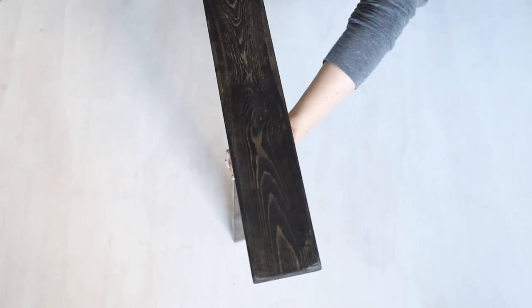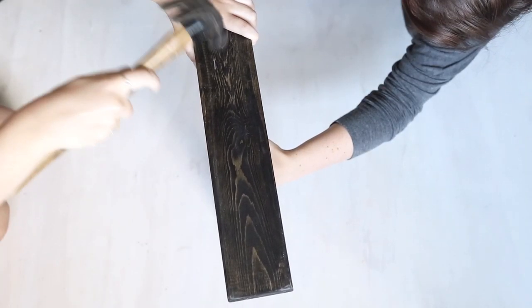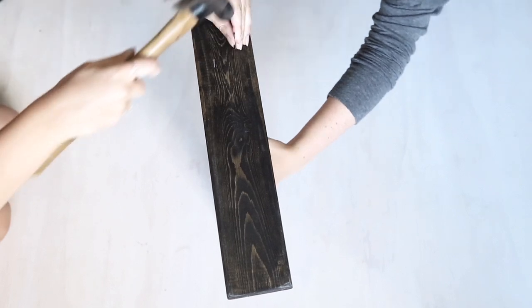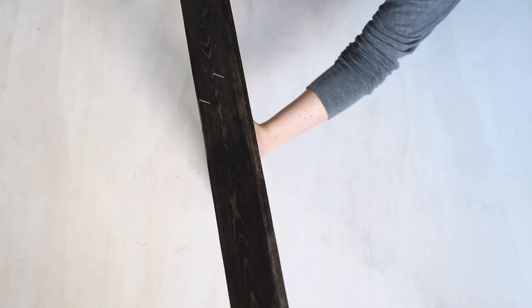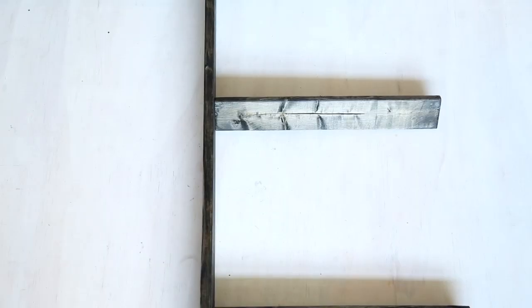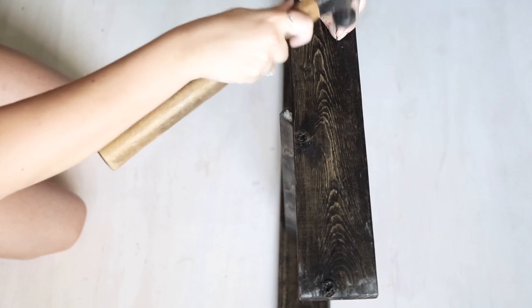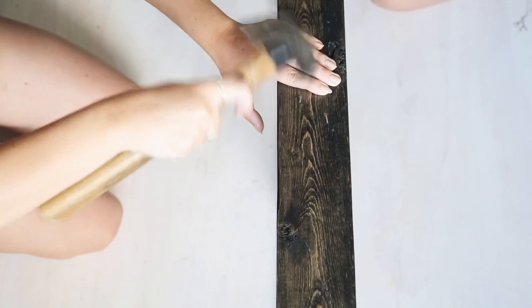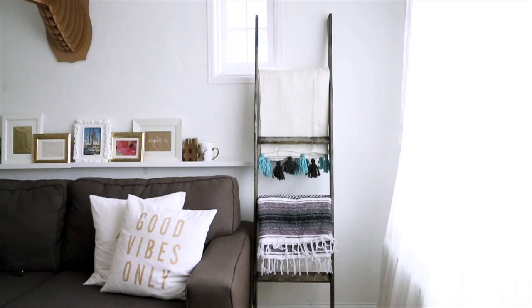After completing this step 4 times on one plank, repeat on your other 6-foot piece of wood, making sure that the two markings are opposite since they have to mirror each other when you hammer them into place. Next, we put the long piece of wood on a box while we added one of the pieces for support. We hammered the nails into the plank with the guidelines facing upwards, only until we could see the tips poking through to the other side. Then we moved the middle planks into position and hammered them all the way in. Repeat for each middle plank. Once complete, nail in the other side — hammer nails where the markings are until they show a couple of millimeters through, then line them up with the middle plank and hammer all the way in. Repeat all the way down your ladder. And please do not use this as a real ladder — it's for decoration only.